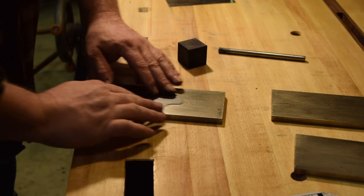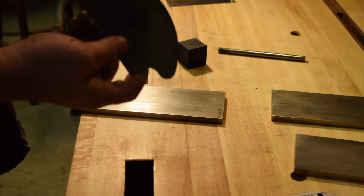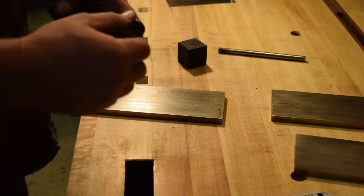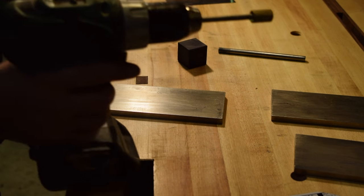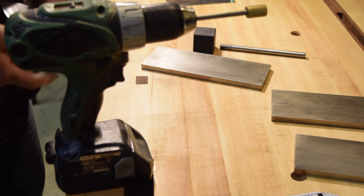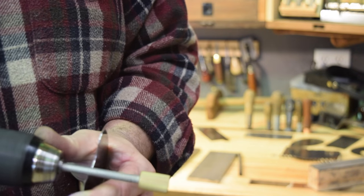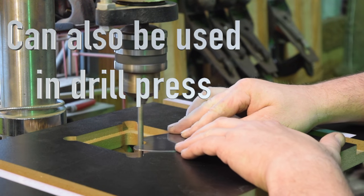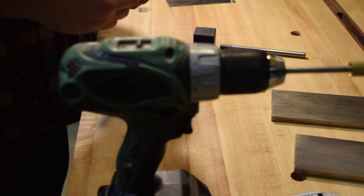I'll go and remove any burr left behind. That does a great job on the outside, but this inside concavity — I had trouble figuring out how to get that sharp. What I came up with was a fishing hook sharpener you can get online for about three bucks, or find at Walmart. I chuck it up in my drill, hold it at 90 degrees, and it diamond-sharpens the inside. It does a really good job — I've been really happy with it.